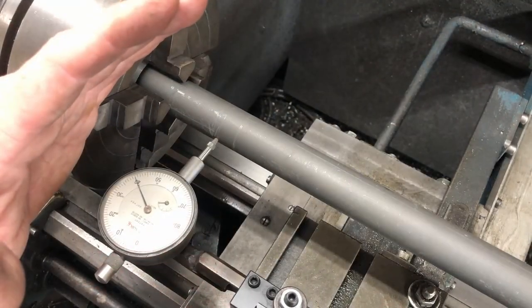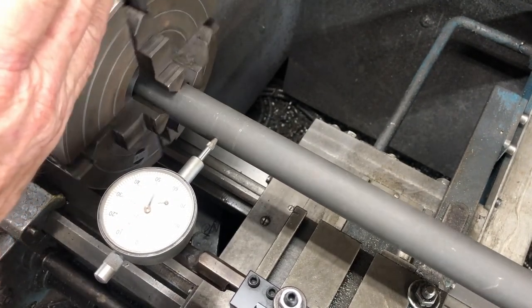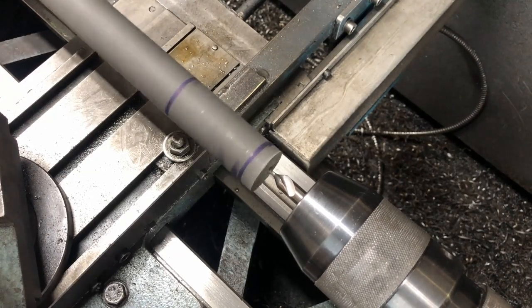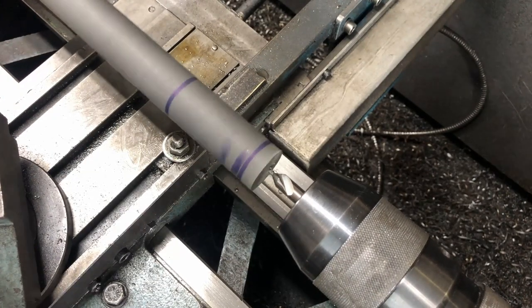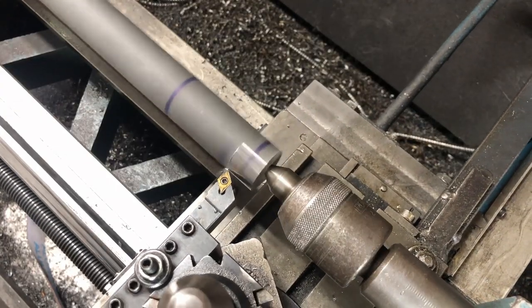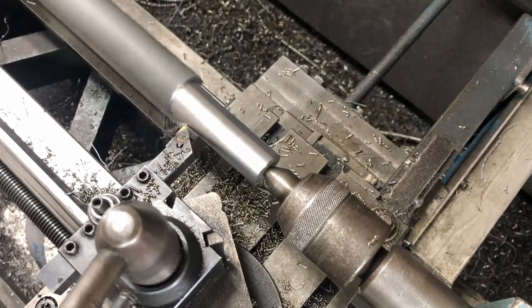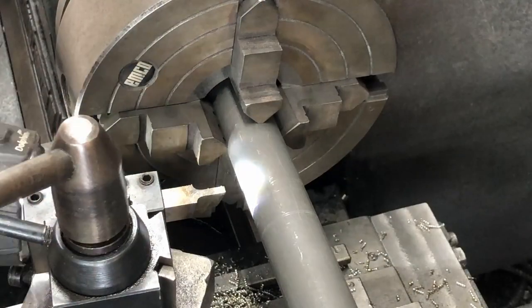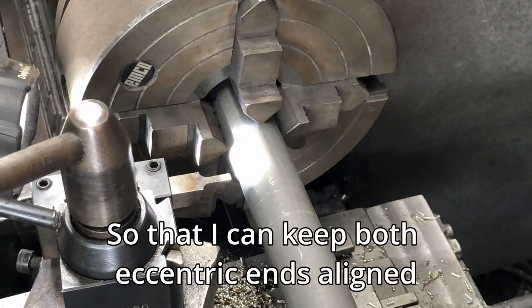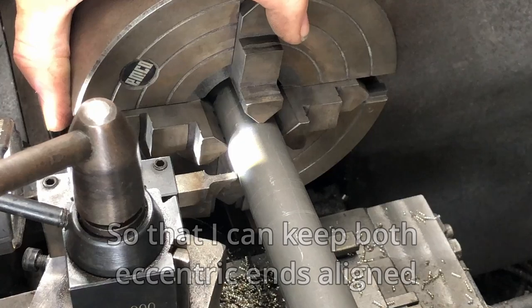Looking at the banjo from the club, there was about three millimetres of eccentricity. This is an imperial dial indicator so I'm dialing up 125 thou, which is just over three millimetres, and I use a dial indicator at the other end as well just to make sure that the eccentricity is parallel. Then I very carefully put a centre in the end and bring in the tail stock for support because this is quite a long bar sticking out. Now I'm turning this down to 20 millimetres. I made a mark at both ends as a reference point so I can set it up in the lathe in exactly the right place to get the eccentric in the right place at both ends.